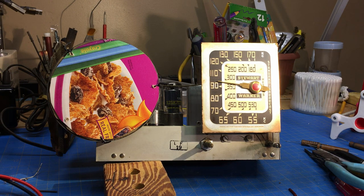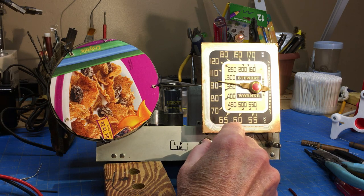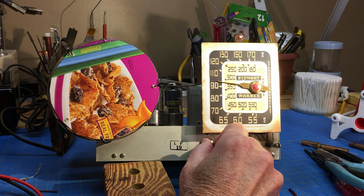Current, everything still looks good. It's one of the things, let me make a comment. If you have a radio that's playing somewhat in the beginning, it's always good to check your components, change them out, and try it again. That way, when you get to the end, if you've changed them all out, you don't really know if you've made a mistake, per se, if the thing doesn't work. So then you've got all the troubleshooting to go. If you've got one that's working, you progress and see how it works. If you change a component and it quits working, then you know that it's something you may have done there.